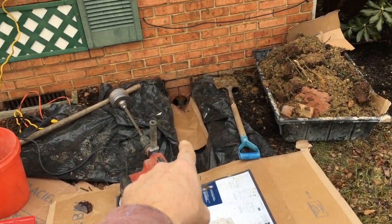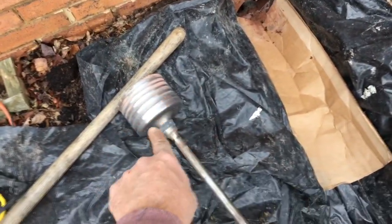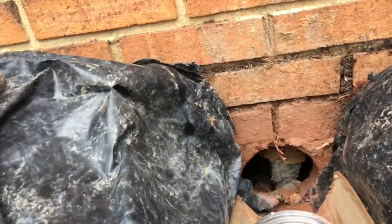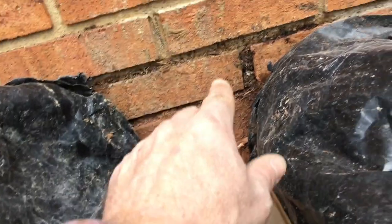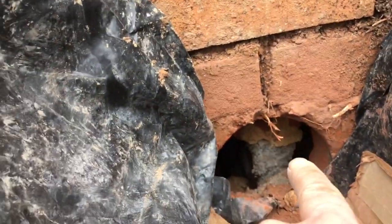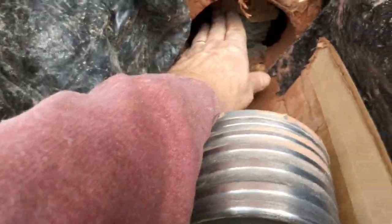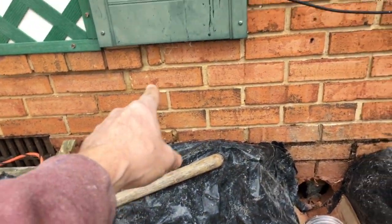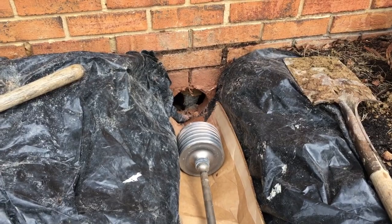That cardboard will also keep the plastic from winding around the drill bit. One more important thing: how to pull your measurements just right. You want to be either in the dead center of the cinder block or right on the corners where cinder blocks are joined. If you miss this, the drill bit will just fall into the cavern. I call it the rule of eights and sixteens because the cinder block is 16 inches — that might make your day someday if you're in my position.